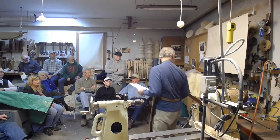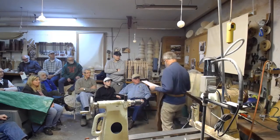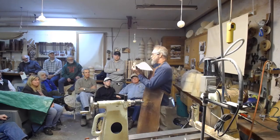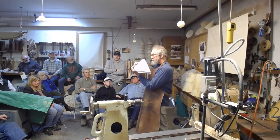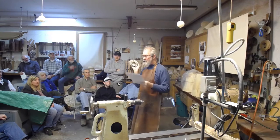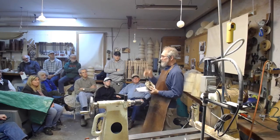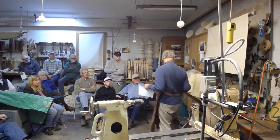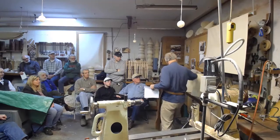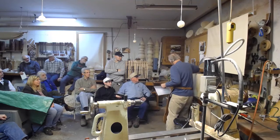Heavy-duty faceplate. I did the first lampshades on regular flat faceplates, but now I do them all on these One Way faceplates, which are much thicker and have these really heavy rims. It reduced half of the vibration issues I was having. It's hard to believe that a quarter-inch thick flat steel plate would be a source of vibration, but it certainly is. And the one that I'll be working on later is a larger version of the same kind of faceplate.